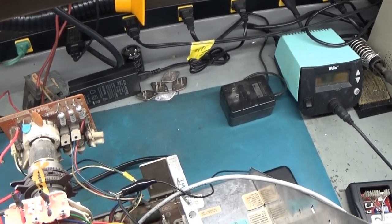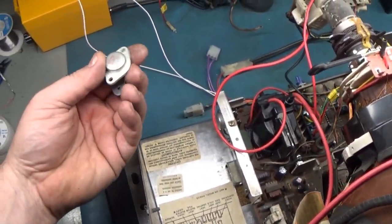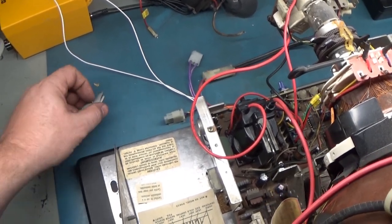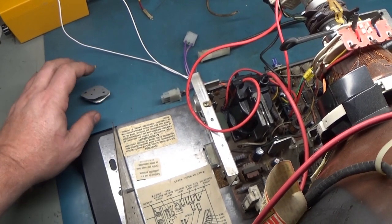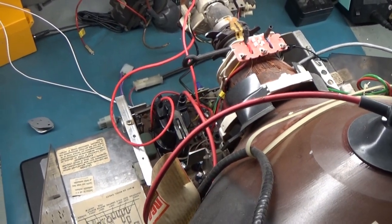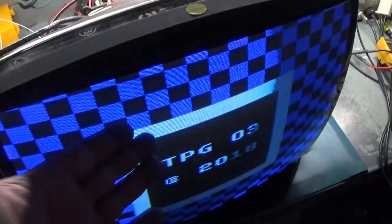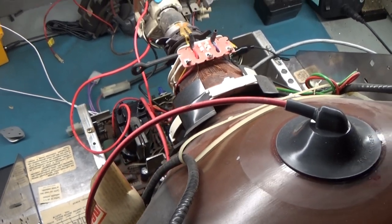But I went through three. The original one is there. I went through three voltage regulators until we found the quite literal smoking gun here. I would have found this much earlier if the note had said HOT sparking and not voltage regulator sparking. But anyway, this is probably the most difficult and head-scratching K4900 I've ever come across. So I'm just glad that I was able to get it figured out. And we all learn. Every time something comes through, we learn something new.